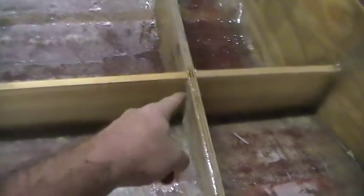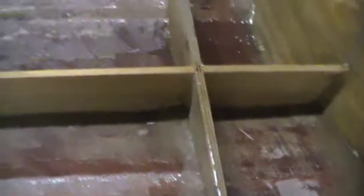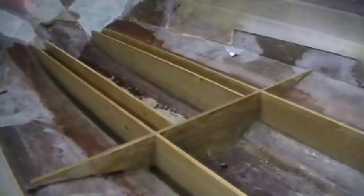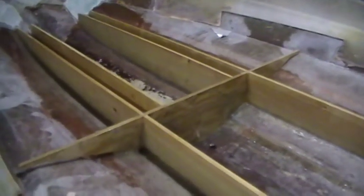Every time I did fiberglass, every time I did a tabbing, I didn't just stop it at the end. I actually took it, cut it in the corner and came all the way over at least 8 to 10 inches. I started looking at my original design — I took and cut the stringer down so far and then cut the top half of the bulkhead so they just slide in and notch right in place. It was really great getting it all in place without having to bed or tab any of it — I didn't have to hold any of it.